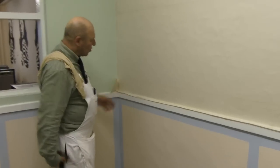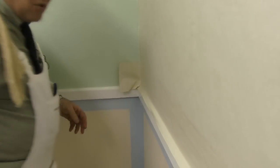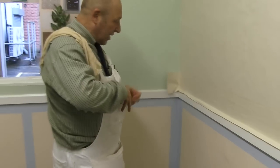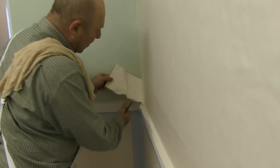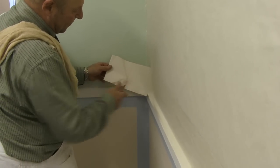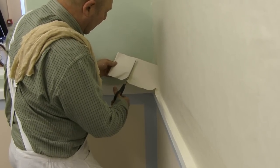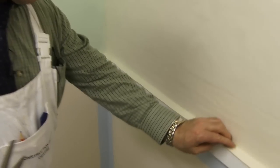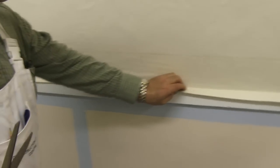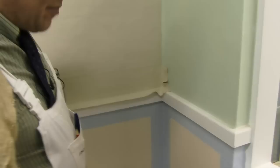Now we're coming to a corner. The first cut in this corner with the scissors is a quick nick into the corner — I'll do that before I put my pencil down. If I don't do that before putting the pencil down, we end up with the paper ripping, and we don't want that. That little nick saves any discomfort when we come to that corner. Working down, I'm just going to stick my fingernails in to make sure they're right into the bottom edge. A little bit of paper — it takes me seconds to get it in my pouch, it doesn't have to be on the floor.